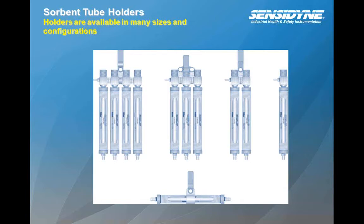Sorbent tube holders — all associated with the constant pressure-type sampling, since you'll be making all flow adjustments on the tubes. Remove the metal knob; there's a screwdriver adjustment. You can adjust to 50 cc's on one holder, 100 cc's on another — perhaps a different size tube of the same media. This gives you a lot of diversity in being able to do your sampling application. If there are just one or two analytes that can be analyzed on a charcoal tube, you're making your flow rate adjustment and using it in a constant pressure-type application. For constant flow, where your flow rate is adjusted on the pump and you're using just one tube, you'll use this type of tube holder.